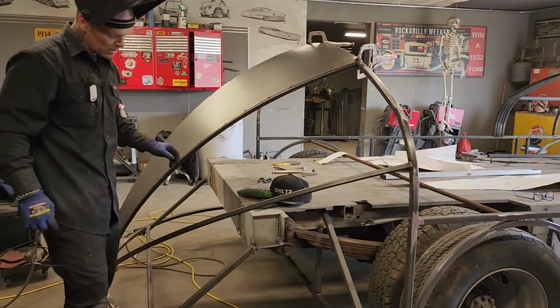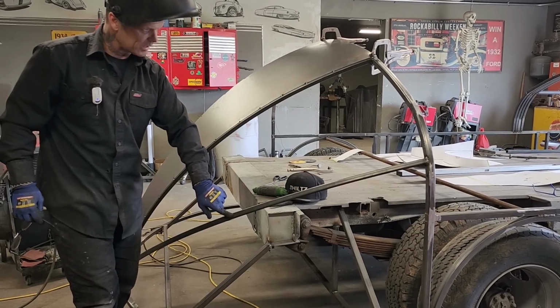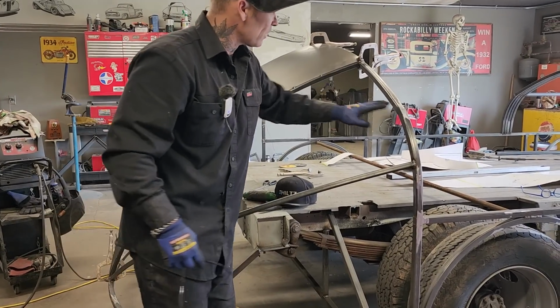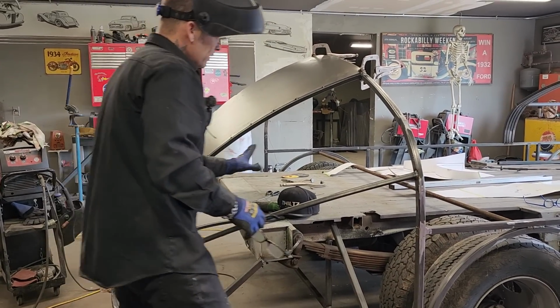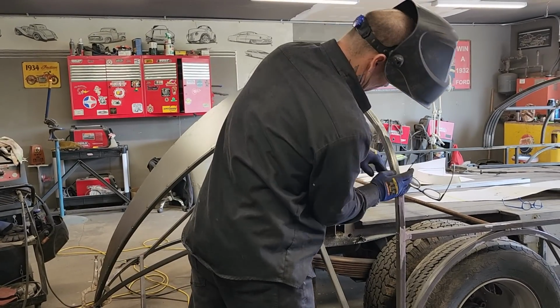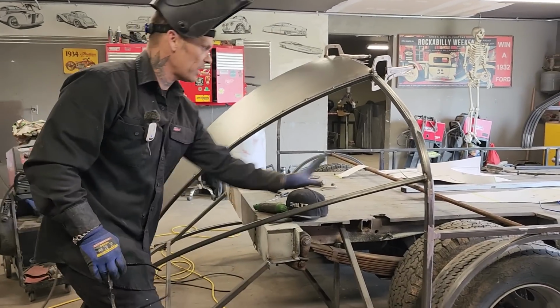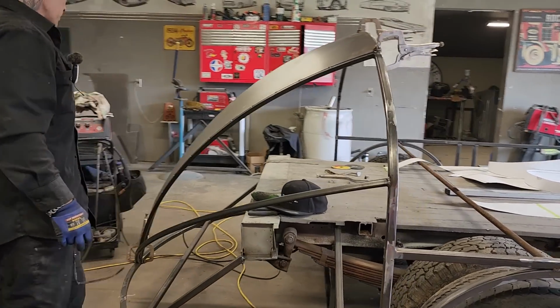We got half on this here, but this edge right here is going to hit first, and then that flat edge, I think. And to get this shape here, what I'm thinking is we can roll this one up, we'll tack it all along here, and then we'll put pressure on it, bring it down around here, and then weld that on there, and hopefully that'll give that a little bit of shape going on there. This one's going to be good. I think it's going to be fine.